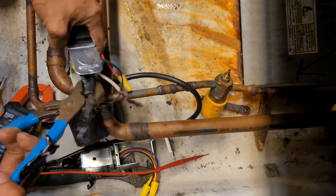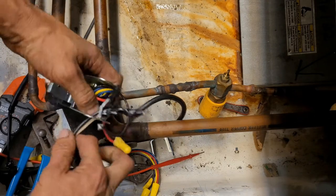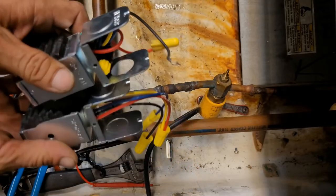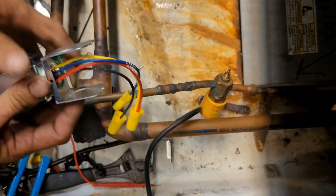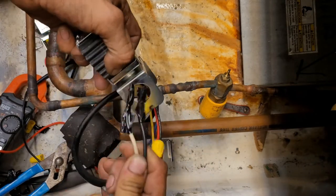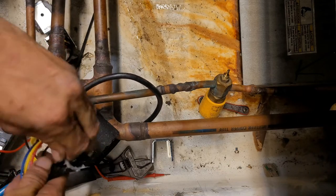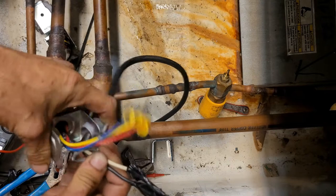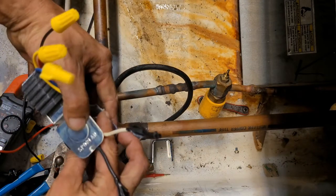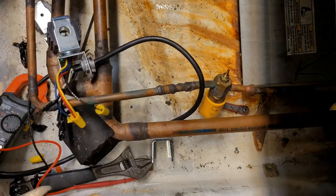This is ready for me to safely pull it out. To make sure I get the knockout on the right side, I'm going to hold those next to each other — it's this one I'm going to take out. Carefully put my hot leads that are insulated back through there, run this little nut back on, and make sure that this threads back on and tighten that down.